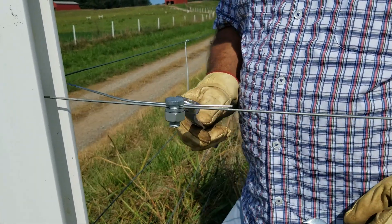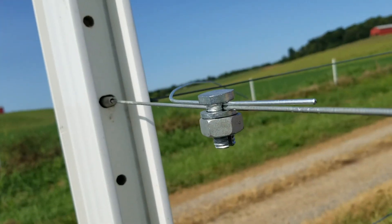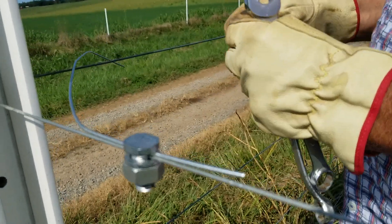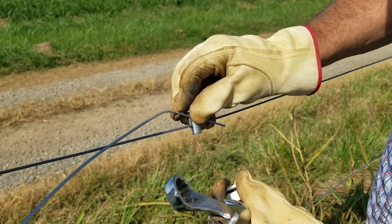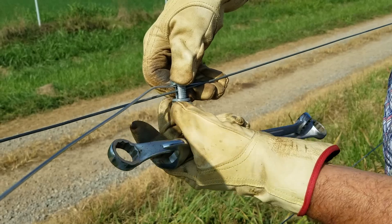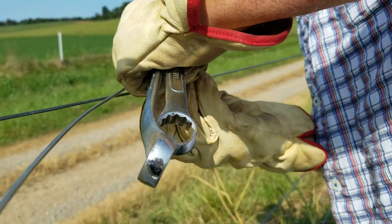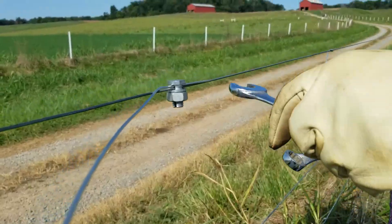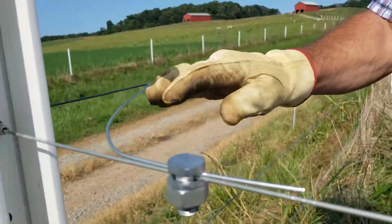You can actually overpower it with those two wrenches and might snap one of the legs off, so be careful. It's very simple and easy, and if you ever want to take it off, just loosen the nut and take the bolt off. We're going to jump it over to the other side and do the same thing — put the split bolt in, then your washer and your nut.